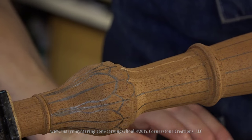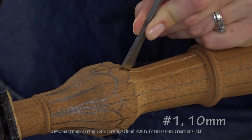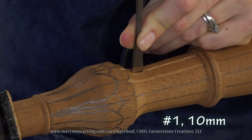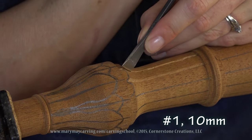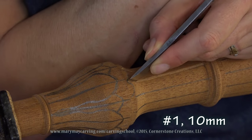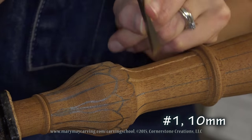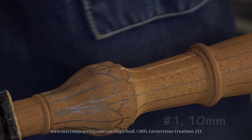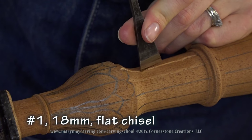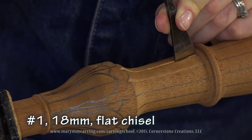I really just wanted to show you how I did the end — this part is pretty standard. I'm taking a flat chisel, this is a 10 millimeter, and just going right up to this curve here. The reason I'm using a small one is just so I can fit it around that curve, and then as it goes along this flat area I can use a larger flat chisel just to really define that inside corner.